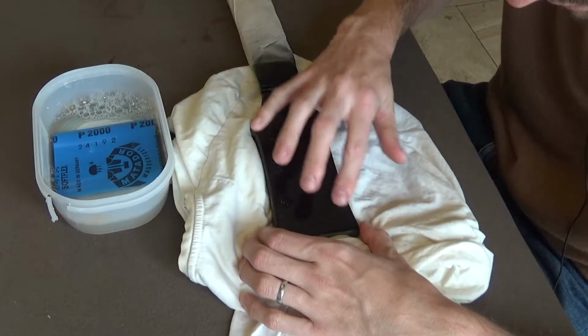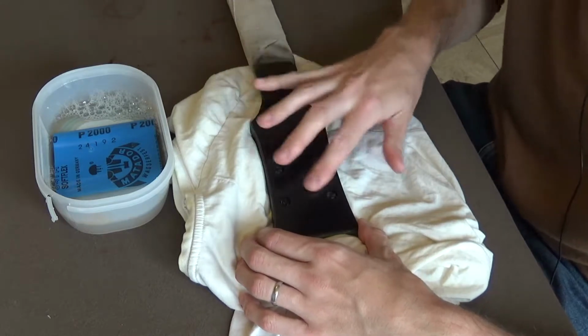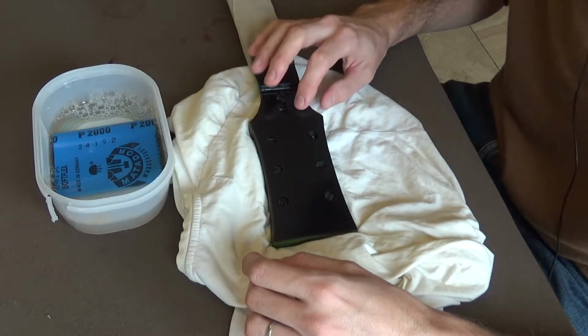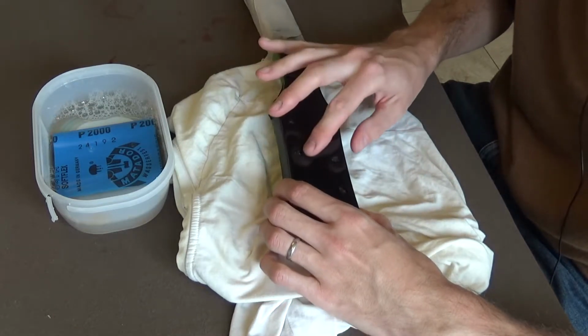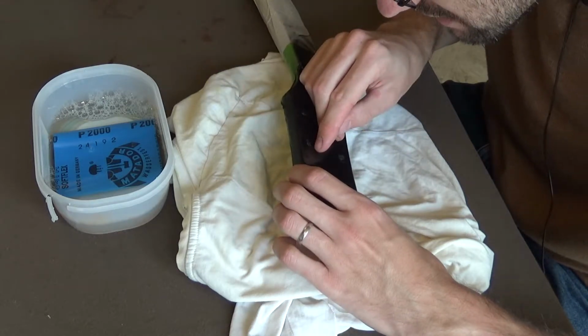There's just a few little spots where you can see the grain through it, which I'm not too worried about. I just want to take some of the bigger divots out. This is 4 coats applied within about 2 hours, so giving about half an hour or so in between each. I didn't try touching it yesterday to see how dry it was, and it's touch dry today. So let's give this a go and we'll see.